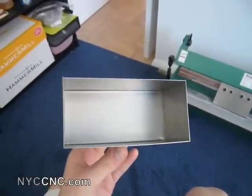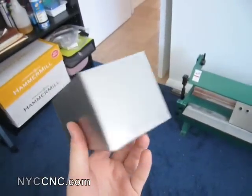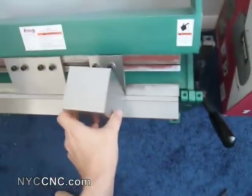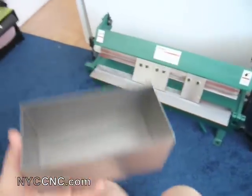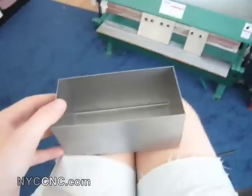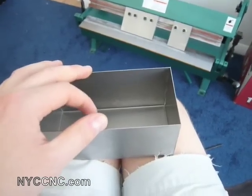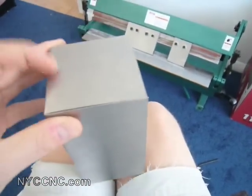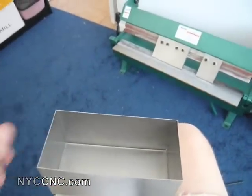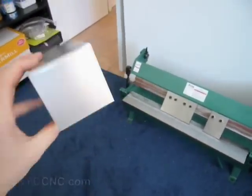Final update — I was able to fix the problem, though I'm not sure if it's a long-term solution. I've got clean breaks on all four corners. What I did was put the piece back in and unbent the two sidewalls I had first bent about halfway — the crease was already there, which was the trick. Then I bent the two longer walls to 90 degrees, giving them their crease, and then bent the sidewalls back mostly by hand, finishing them off with a hammer. It wasn't too hard since the crease was already there. I'd like to find a better long-term solution, but mission accomplished today — pretty happy with the end result.